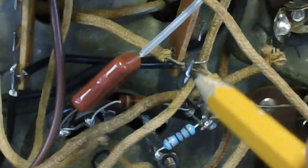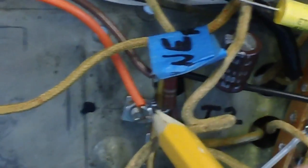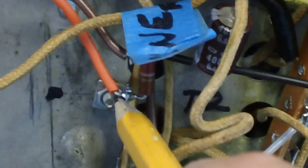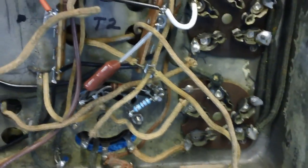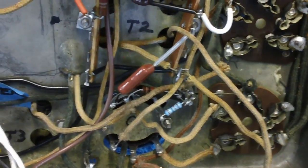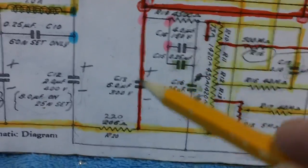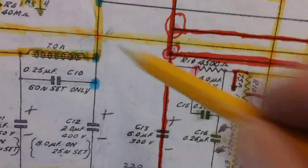All right, let's follow the old wire to the rear and see where it goes. It comes up to this terminal board right here, and it connects right there on the end, that last terminal. And we need to connect the positive from the orange wire to that one right there that runs down to the back of the switch. Oh man, are you kidding me? Oh, well, how can it get any easier? All I have to do is take my negative, this one here, and connect it to the orange. The positive will go to the switch.